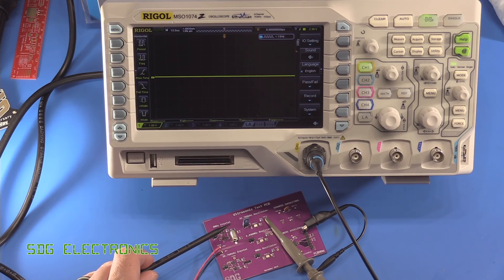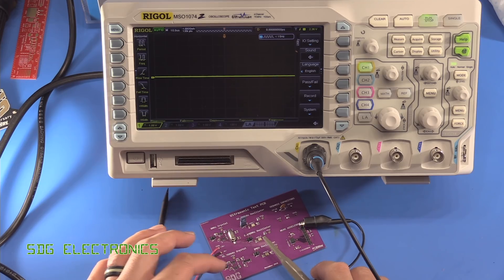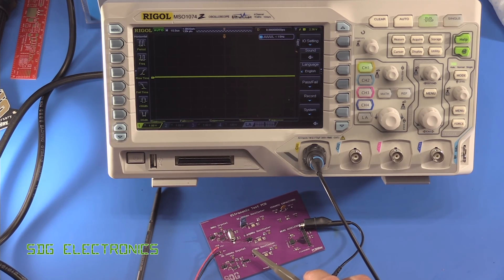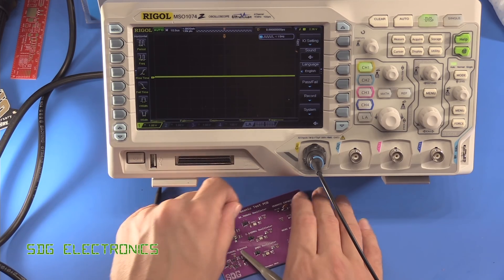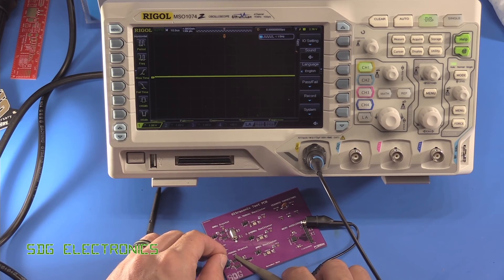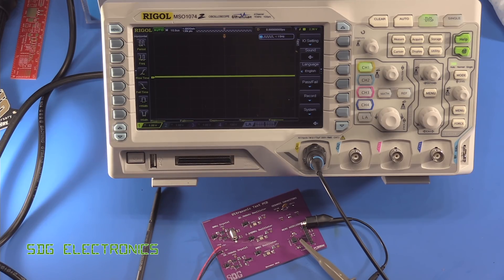We can test the 32 kHz oscillator — let's turn that on. And there we go, that seems to be behaving properly. I'm expecting that if any of the crystals are likely to get damaged, it would be the 32.768 kHz crystal, because that frequency is very similar to the kind of frequencies used in these ultrasonic baths. Let's try the crystal zone with the separate oscillator circuit — and that one's also okay. I'll connect these up to the frequency counter again and take the readings.